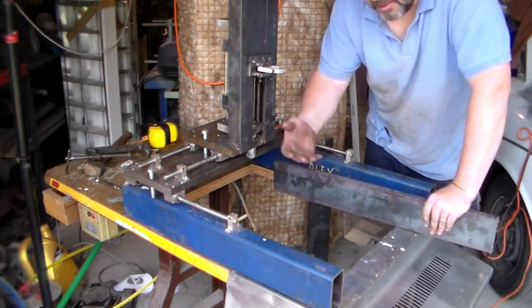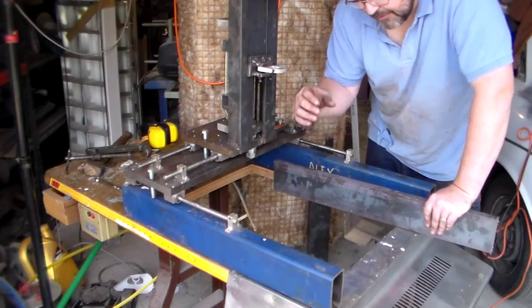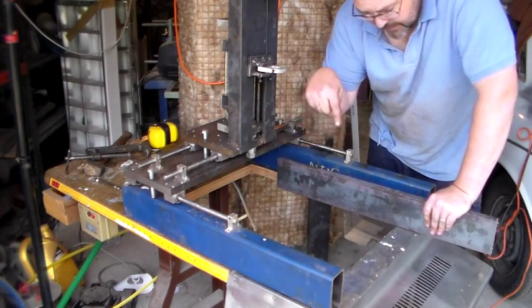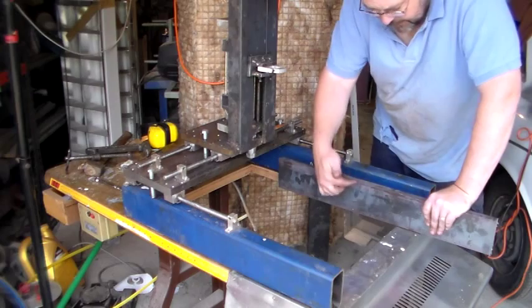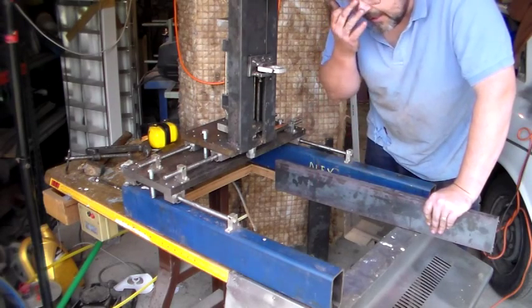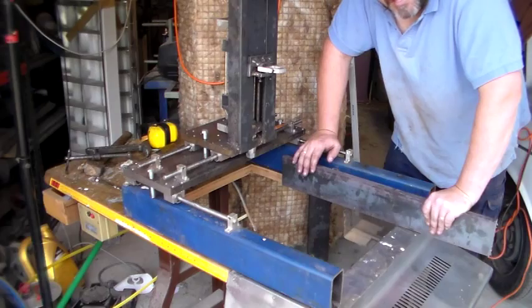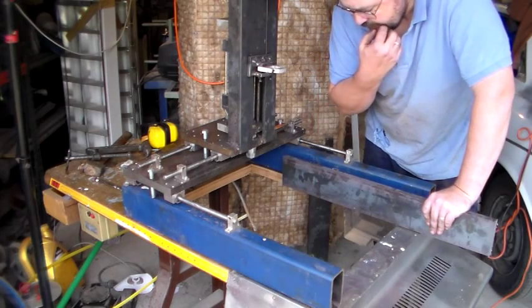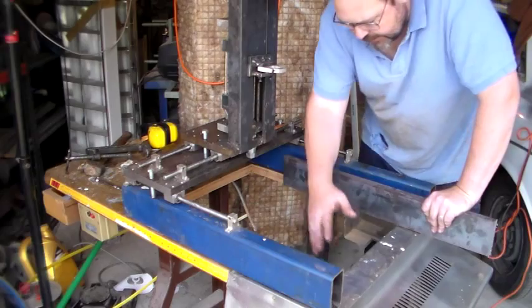In a traditional plastic injection molding machine, the repetitive process works like this: once the mold is cast and the piece is set inside, the machine opens the mold up and you have a couple of ejector pins that will eject the casting and it drops down below. At this stage, even though I'm planning on having each half of the mold screwed into the clamp plate so that opening them opens the mold, I'm not putting ejector pins in at this stage. However, should I add those in the future, I want the ability for that part to drop down underneath the table into a collection bin.